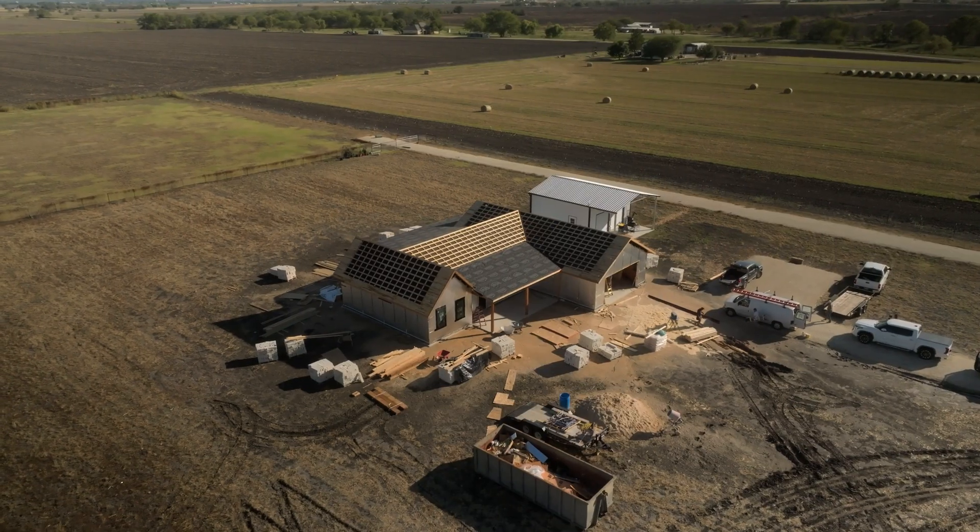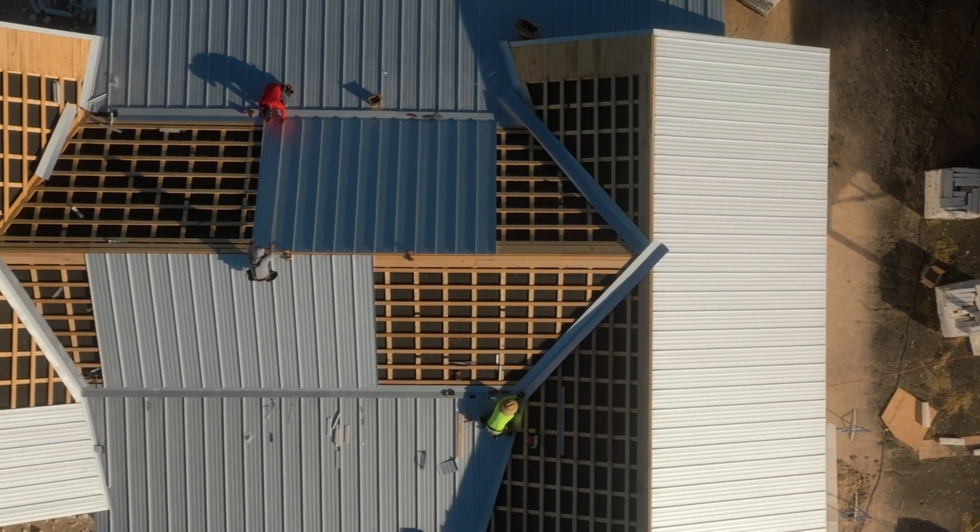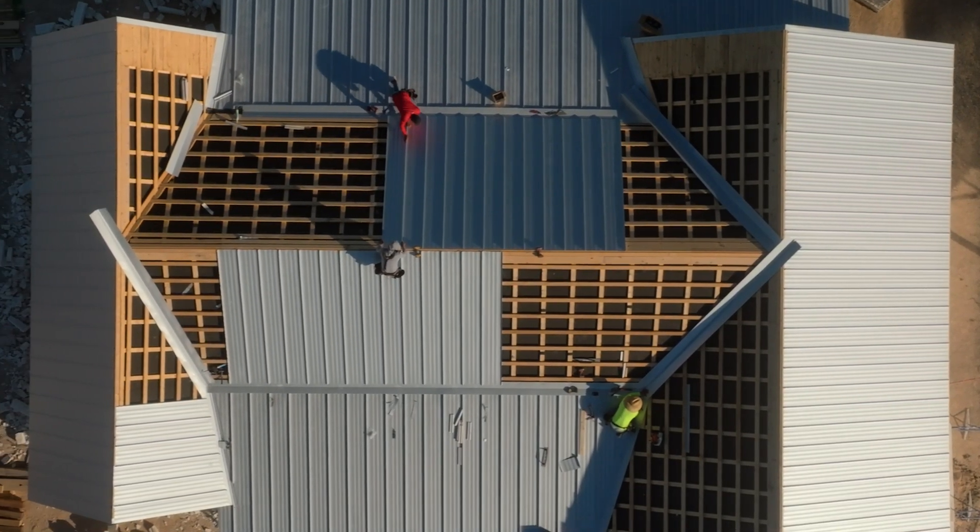As we get down to Texas or more temperate climates, I'm not as adamant about it, but I think it's a really good idea. On this house, we decided that our big problem was the expansive soils. When it gets dry, these huge cracks open up in the black dirt. When it rains, those cracks fill up. We're talking about inches worth of movement, and that's tons of pressure pushing against these foundations.